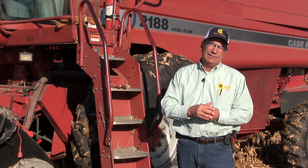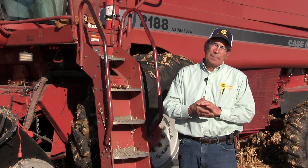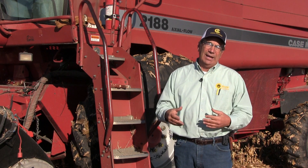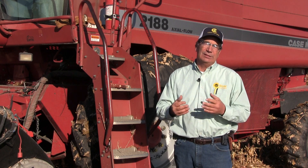This year the crop's drying very fast — a lot of dry corn this year. So every year I keep continuing to slow the corn head down. You can slide out, just take half of the header, and see what your maximum speed is. If you can run six or seven miles an hour with half the head, I would think the header's too fast. Slow her down and try to keep the kernel damage and shell corn to a minimum. As I always say, if you don't butt shell it, you don't have to worry about cleaning it up.